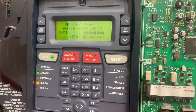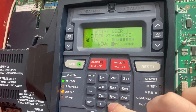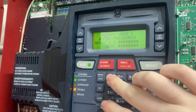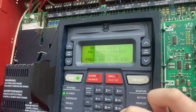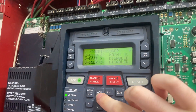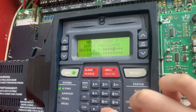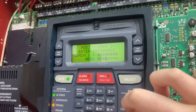Okay, firmware update is complete. Here's what we're doing now — you're going to change each of the passwords to get rid of the password faults. The role is 'maintenance', escape, user 2 enabled. Then in our admin password — admin password can be whatever you want — I just chose a random password and I wrote it down inside the panel. I set user 1 to be the maintenance user.